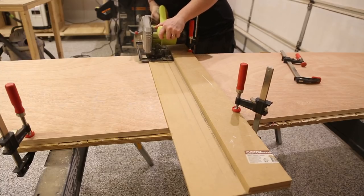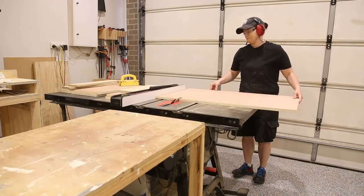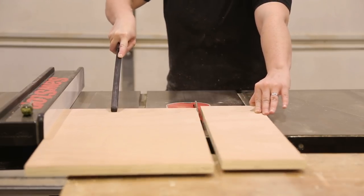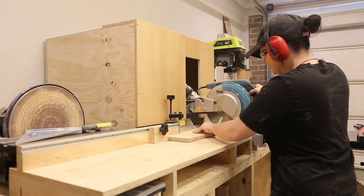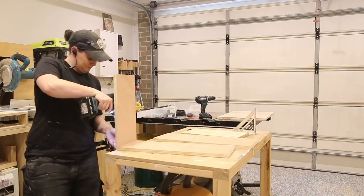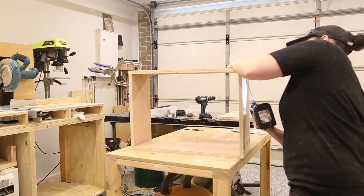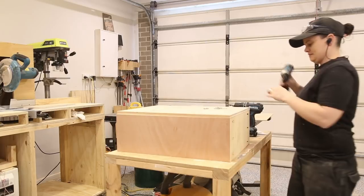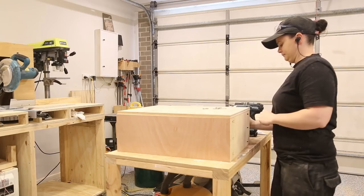Now onto part three — the bottom part of the workbench. I'm not going to go into huge detail about making drawers as there are many videos out there. For mine I use pocket holes, keeping them on the front and back so you don't see them when pulling out the drawer. The main thing to consider is what you're going to put in them. The bottom drawer houses all my routers and router bits so I made it taller to fit the router standing up. The middle drawer is for my sander and sandpaper, and the top drawer is for my jigsaw and drill bits. I reused the drawer runners from my old workbench, so I just needed to account for that when making the drawers.